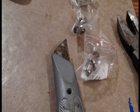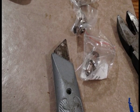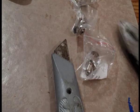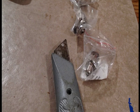So let me see if I can get the sleeve on. I should probably strip the ferrule ahead of time. Okay, now I want to try to leave. I'm going to try to spread out the braid as much as I can. I don't know if you can see that there. Okay, now it looks like the next thing to do is to take a pair of strippers and prep it like this.